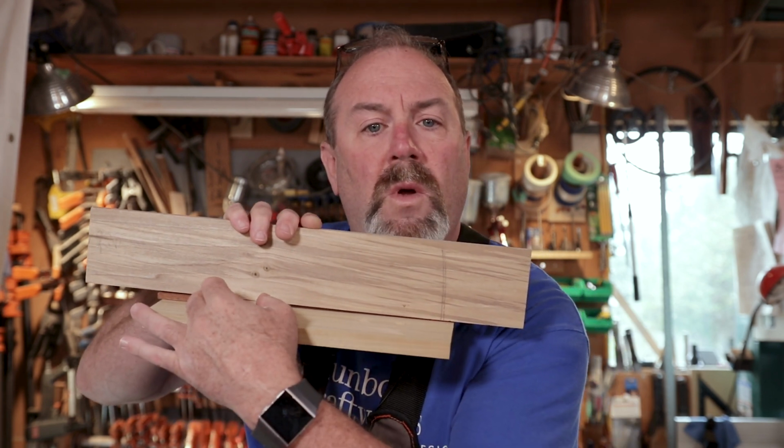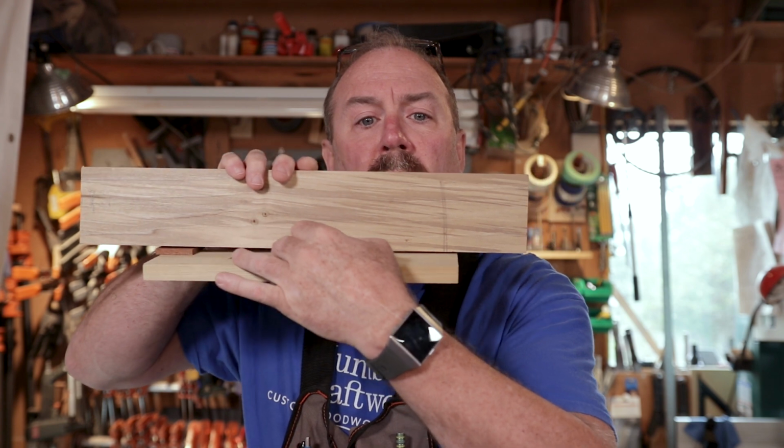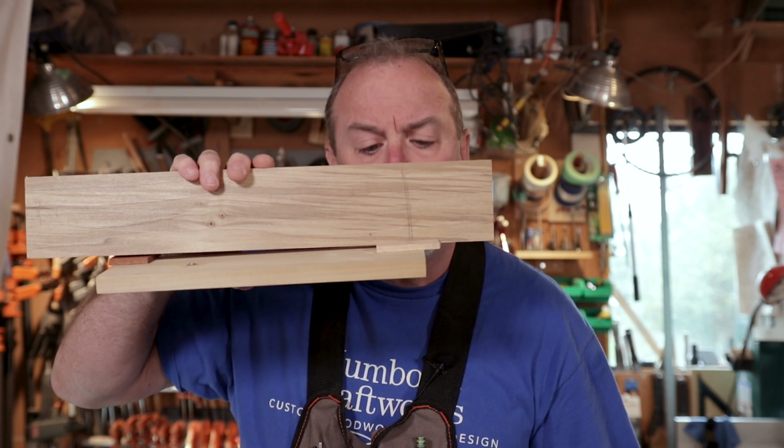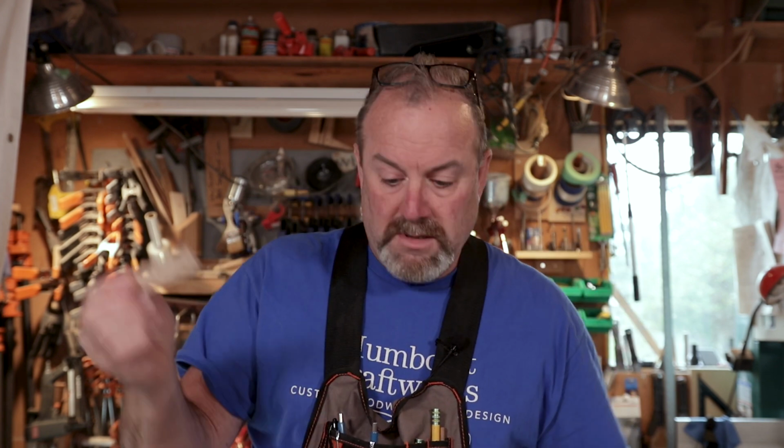And you just take your pencil and run it right like this over here all the way, and that way you can scribe right to the floor. So these little guys work great as scribes too, whether it's a 1/16 of an inch, 1/8 of an inch, 1/4 inch, whatever. Just take out your pencil, run it along the floor, and off you go. Whatever the biggest gap is, if you can stick one of these in there and go, oh cool, it's a 1/4 inch, it's got a big hump on the floor, you just come along and scribe over the whole thing.